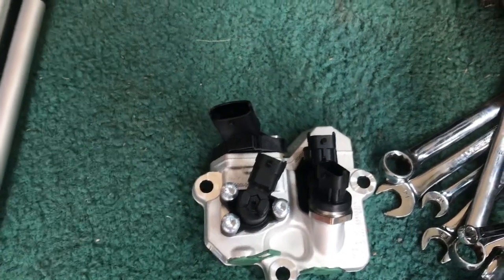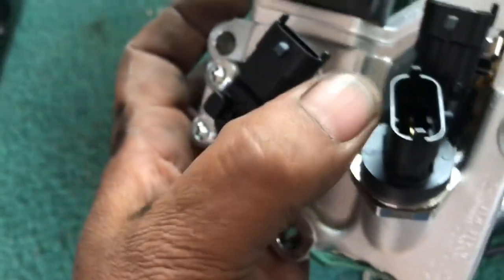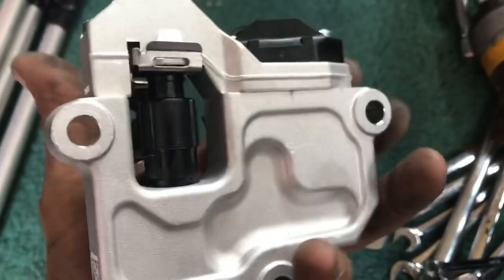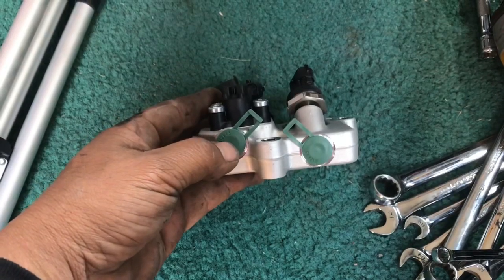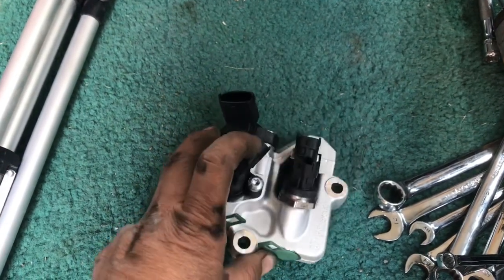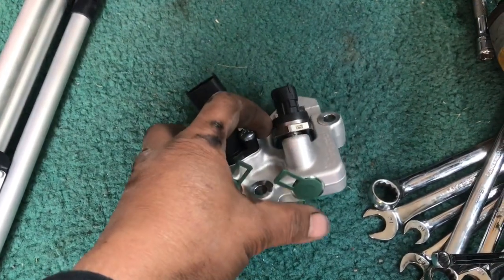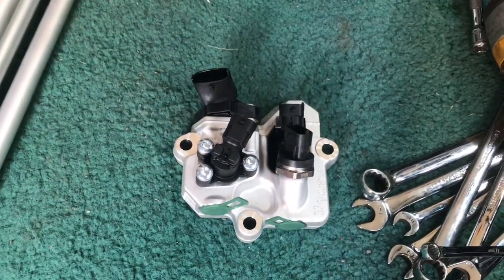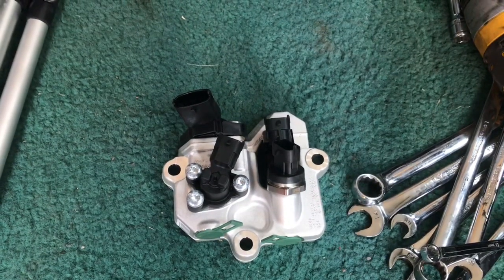This is a MaxForce 910. This is the part in question - this is the one we're gonna replace. As you can see, the injector is right there - pressure metering valve and so forth. This is a metering block. From here, fuel comes into it, and this is the one that is connected to the injector nozzle on the exhaust. Whenever regen goes into play, this injector starts pumping fuel through this line and it goes into your exhaust.